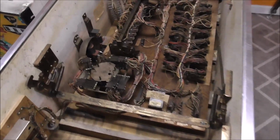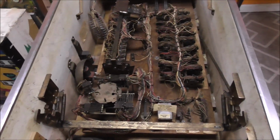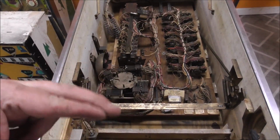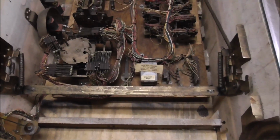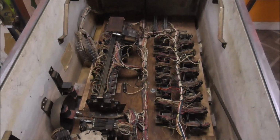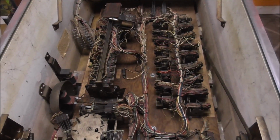With no documentation and no knowledge of it, you can just tell by looking at them, you know? So if a switch is smashed like this and whenever the relay pulls in, it's still smashed together, well, something's wrong. It should open up one way or the other. Right? So you just go through and check all that stuff. See if you see anything obvious. Now, whenever we put this back together, it'll likely have some issues, and we'll fix it with the schematics. We'll figure it out then.